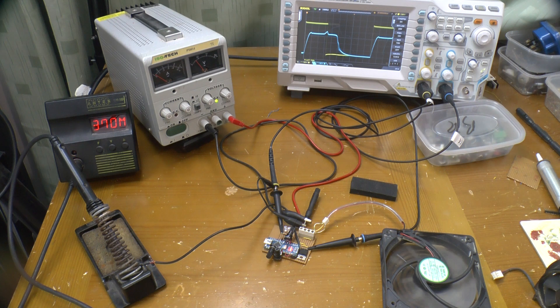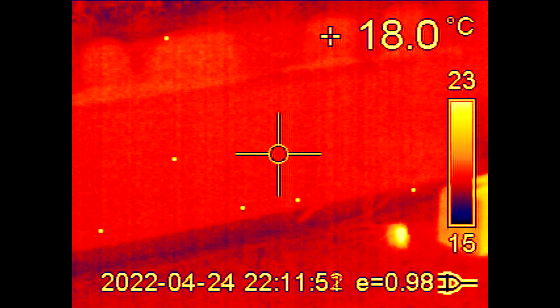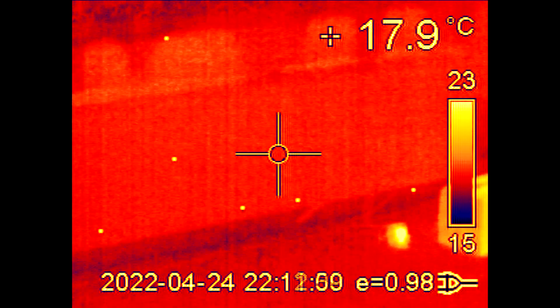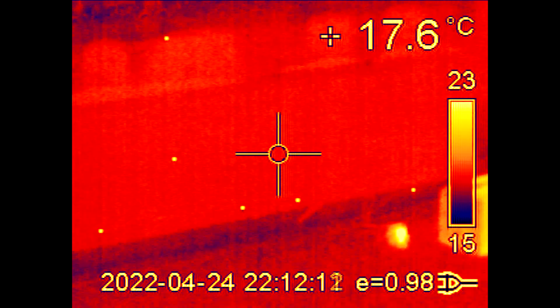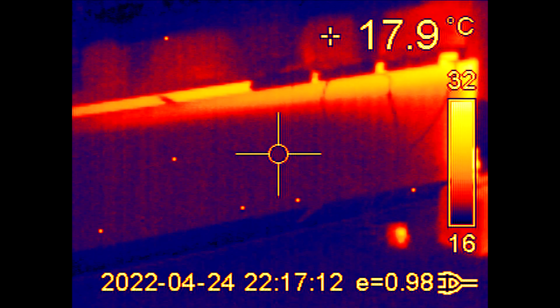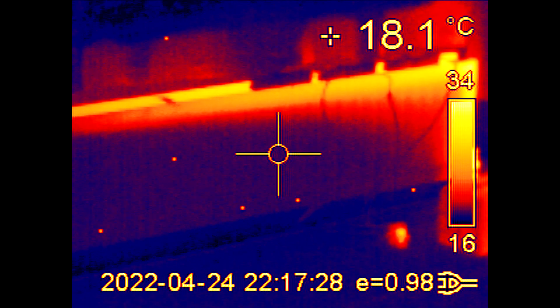If I fit some fans to a radiator, what sort of difference does it make? Let's dig out the thermal camera and find out. I've got three blocks of Xbox fans — six fans in total — all sitting on the right hand side of this radiator. The left hand side doesn't have any fans on it. The hot spot down at the bottom is the Arduino. I've got the temperature sensor clipped onto the bottom of the radiator with a clothes peg. Let's see what happens when I turn the radiator on. Interestingly, you can see that the radiator warms up in the top corner first because the right hand side is where the hot water comes into the radiator and it's flowing up to the top first.